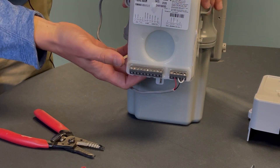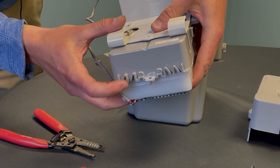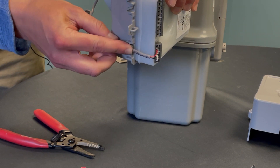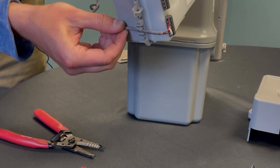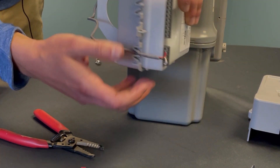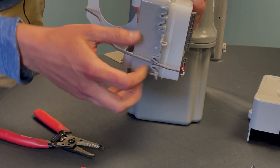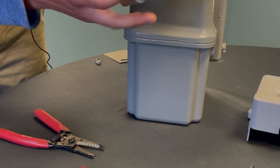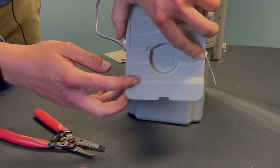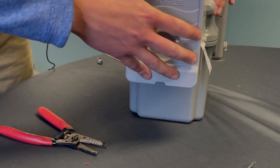On the bottom of the smart point there are tensioners — you'll want to slide the pulse wire through these, as they prevent any pulling from actually removing the existing wires from the ports. You can see that giving it a pull does nothing. Make sure that is installed appropriately. Then add your cover back to the front of the smart point and you should hear it snap in place.